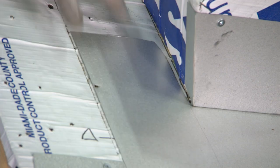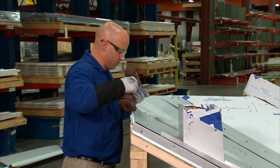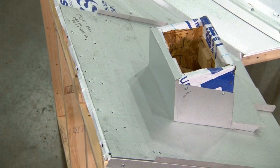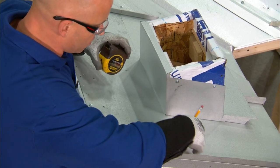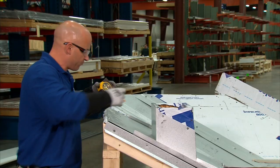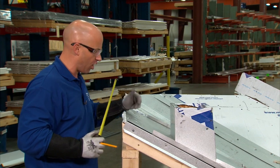I'll put the tube sealant all the way across and then install the flat pan. I have the flat pan in place. I'll secure it with a couple screws. Then we'll determine where we're going to attach our offset cleat. We want to come across the same cut that we have on the bottom of our flat pan, then continue all the way to the rib and place a mark on the rib on both sides — both the female and the male. From that point, we're going to choose points up above the penetration and connect them to put offset cleat all the way around the penetration.